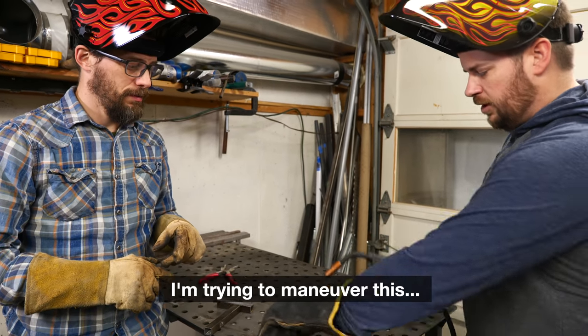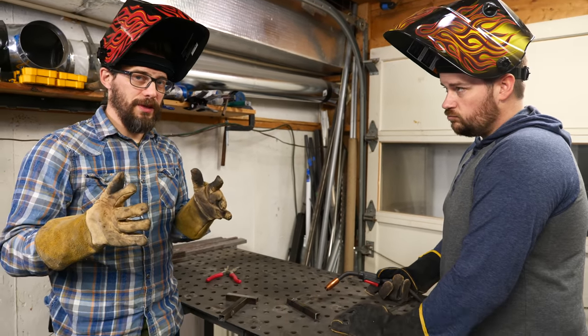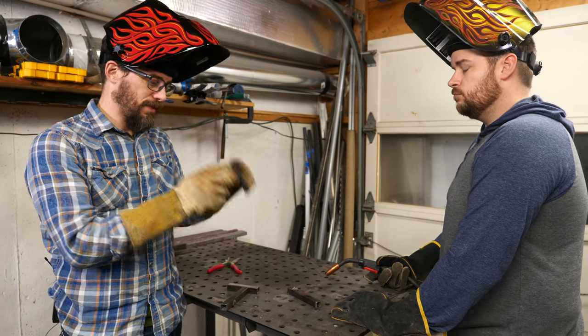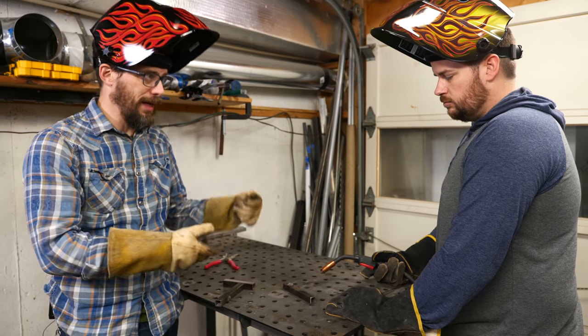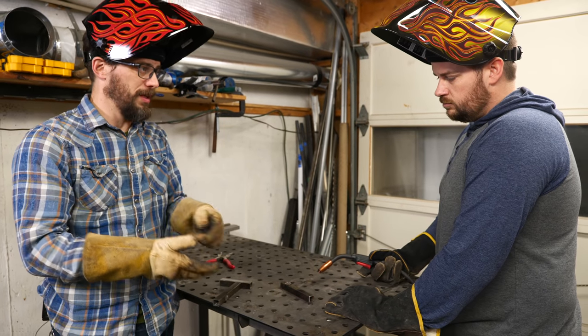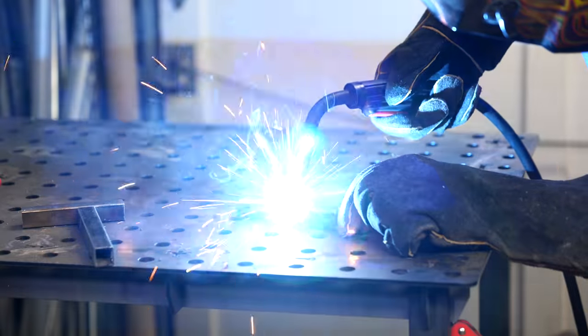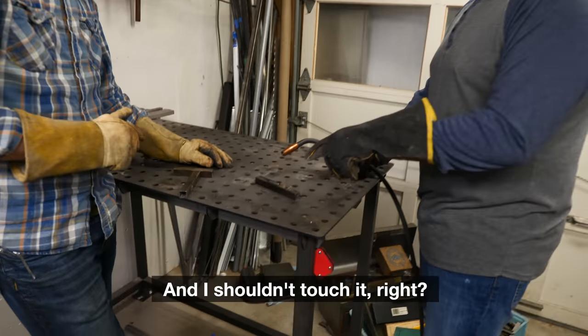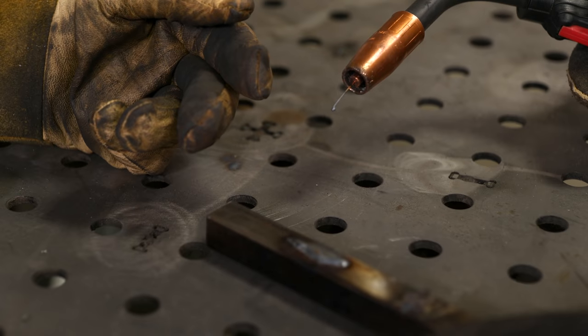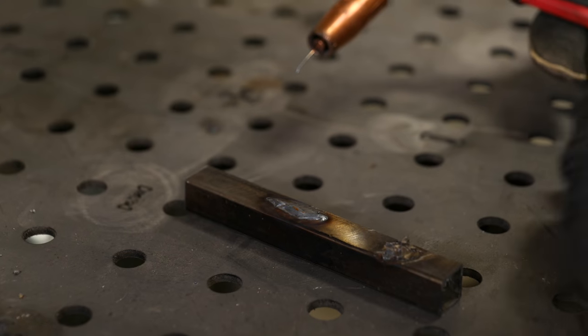I'm ready to do the test bead, but I'm trying to maneuver this. Do I push or do I pull it? Everybody that I've listened to has a different answer for that question, and I think it honestly depends on what you're trying to weld. In this case, do whatever is comfortable so that you start to understand how to weld. They're crackling. Then I touch it — and I shouldn't touch it. See how much wire is stuck out here too? We may need to turn the feed down a little bit so it's not coming out as fast, because that's going to want to run into the metal more. You could do that a couple of different ways — you can cut this down, or you can move your hand faster.